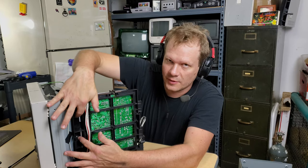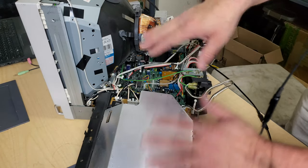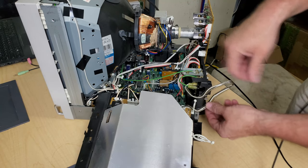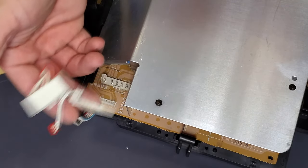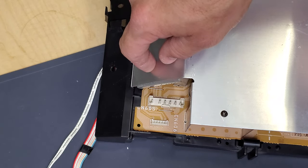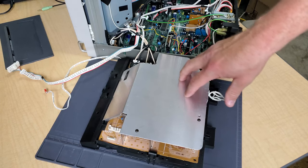This board we're working on is generally held with two Phillips-head screws. We've removed those screws ahead of time, and now you just slip this board down. Here's our main power supply board laid out. We're going to leave the degaussing cable and power button connections plugged in. All the other cables over here need to be disconnected and placed out of the way — those are the areas we're going to be probing. I've got an anti-static mat here to place it on safely.